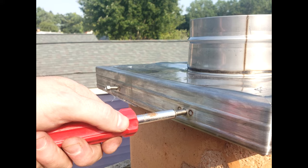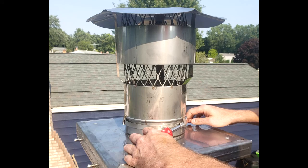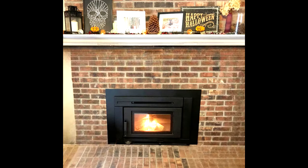With the chimney liner seated inside the collar of the top plate, you can then tighten the hose clamp on the exterior of the top plate to support the liner inside the flue. Lastly, you can install the chimney rain cap over the collar of the top plate and tighten the quick-connect hose clamp for an easy installation. And there you have it — the installation of a wood-burning fireplace insert.